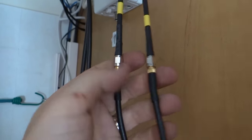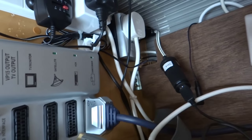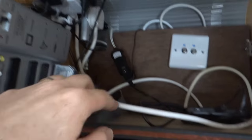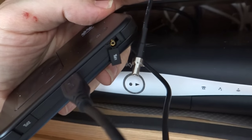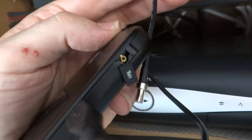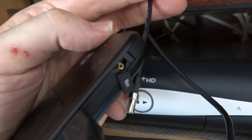I've screwed on the antenna cables and drilled a couple of 9mm holes through the side of the wardrobe, so they're now popping out just around the back. I'll coil the spare cable around the back, drop the excess over, and connect it to the MiFi. The antenna cables are through now, so I'm just going to attach them to the MiFi — they basically just push onto these little connectors on the bottom of the MiFi device. And that's the job just about done.